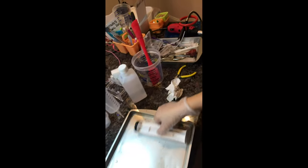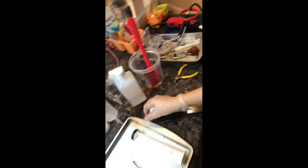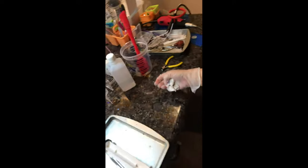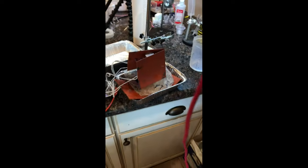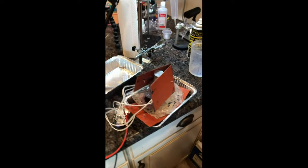Okay, so pigments, where's my, oh, I put my tray over there to dry off, didn't I? I've taken it out of the rotocaster, and I've put it on fast cure now, so it's all wrapped in heaters, so I'll be able to demold that in a minute.